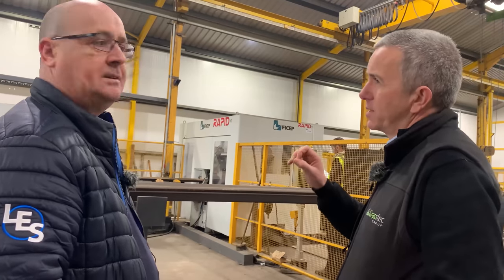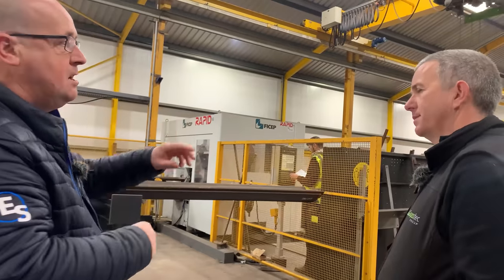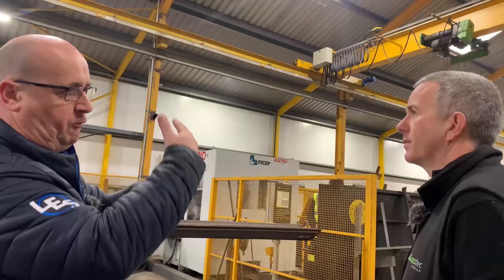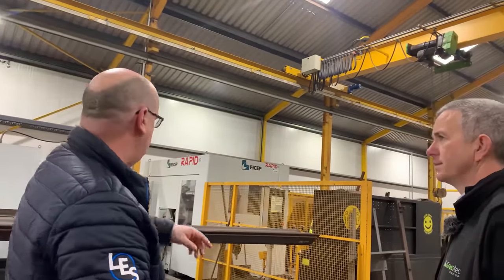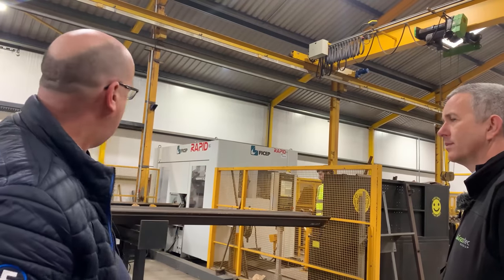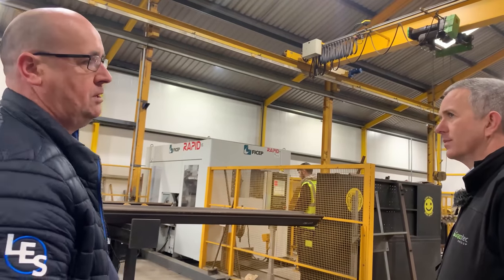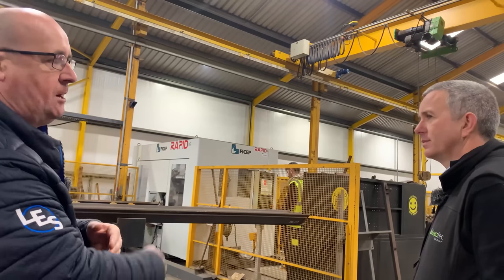Is the one bit doing that, or is it two different tools? Two different toolings inside of it. As I showed you below, it has a cassette with all the different tools inside the cassette. So basically it takes your angle iron in, takes it in a V-shape, and onto the conveyor. Then the gripper takes it and pushes it through, so it does all the drilling and tooling first, and then it chops the angle iron.